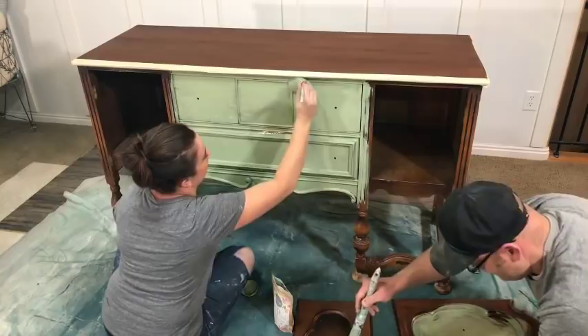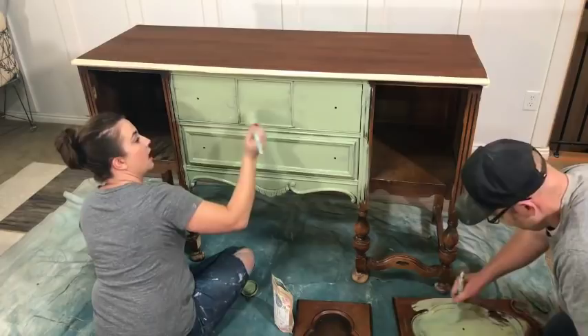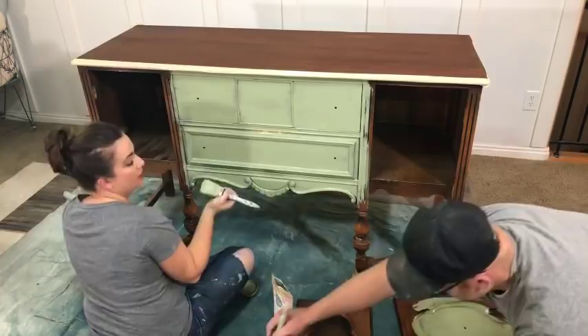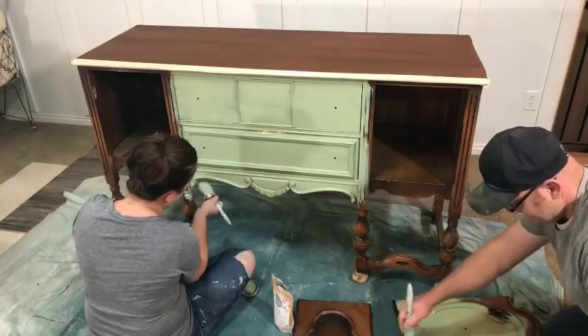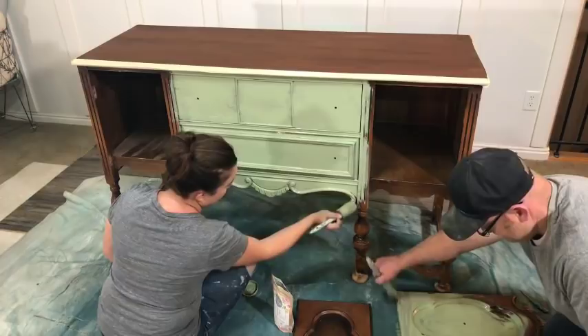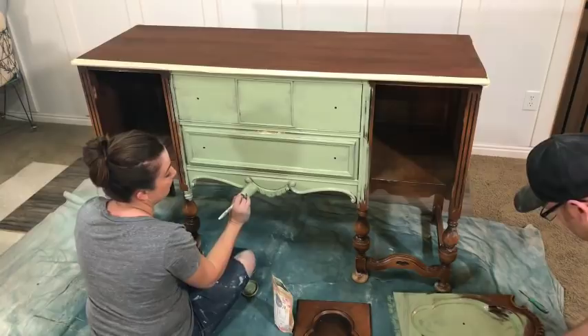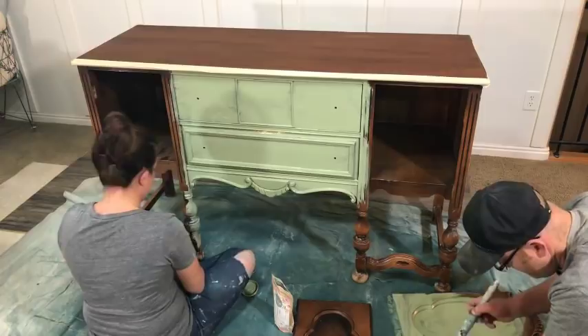Your opinion on chalk painting kitchen cabinets — I think that's a great option. If you're going to use it, I suggest using the Fairy Chalk Mother high bond primer no matter what brand. Go to my Facebook page and look up the video for high bond primer. You want to clean your cabinets really well, and if they're kind of shiny, sand just a little bit. Then primer, then chalk paint, then seal with something durable. I do not suggest wax — I suggest a poly acrylic water-based. If you're doing white paints, don't use regular polyurethane; it will yellow.